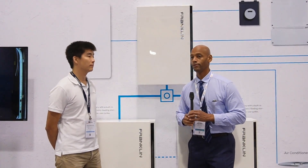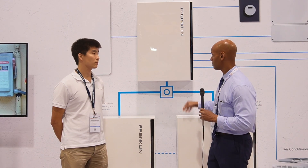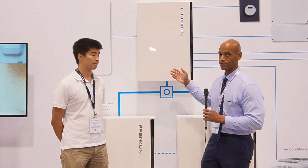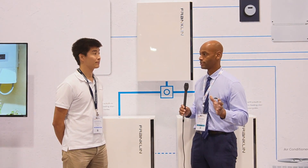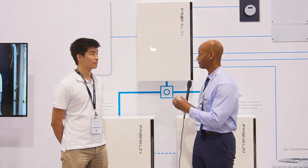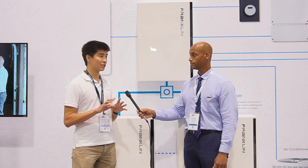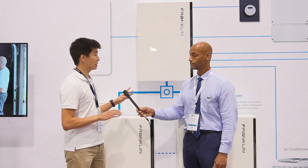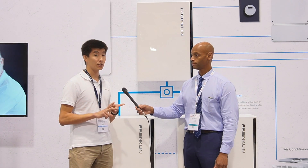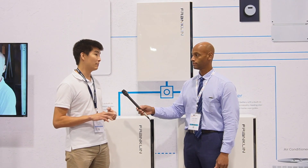From an installation timeline point of view, what I like about this having installed a number of different battery systems is that I'm looking at probably a two- to three-person installation crew for about half the day. We mount the batteries, mount the A-gate transfer switch, and then we're just landing a handful of AC circuits to the transfer switch, keeping the in-the-house wiring the same. Doug, commissioning really only takes 10 to 15 minutes — we do not have the hours-long commissioning process involved with other systems. A lot of other components, like your automatic transfer switch or CTs that are mandatory for other systems, are pre-built and pre-assembled at the factory, built into the A-gate controller already. That saves time and reduces field error.